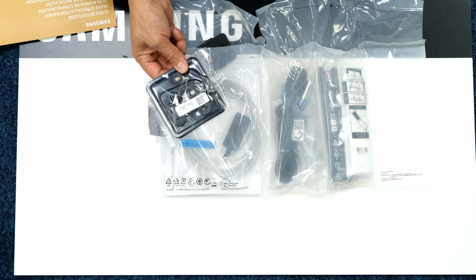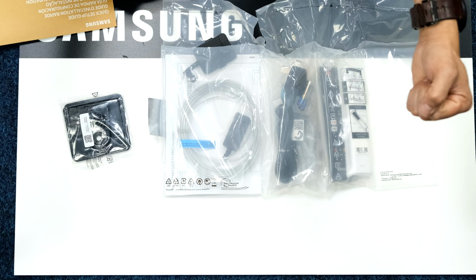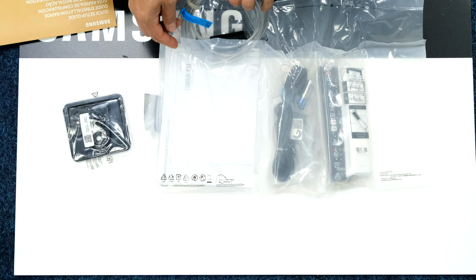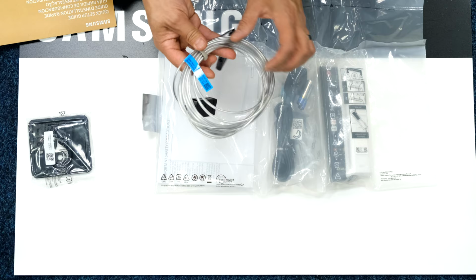That'll teach you how to wall mount, but basically 2 bits screwed to the back of the TV, plates on the wall, and it plops on. It also allows you to rock it to get it level. There's a template in here to help you mark the wall up as well, although I usually measure where the brackets are and where I want the top of the TV, do it that way, but it's up to you. Have a look at the video if you're stuck.